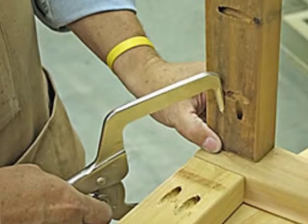While the clamp is in one of the holes, into the other you will insert a Kreg self-tapping screw with the square bit that we talked about earlier, drive it in, and then remove the clamp and put in the other one. And you can repeat that on all of the different surfaces that have Kregs.